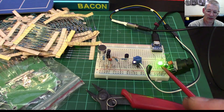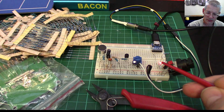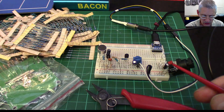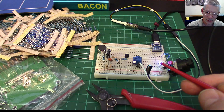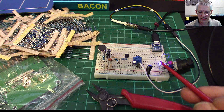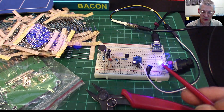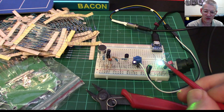The effect you're getting on camera is nothing like real life — all LEDs seem to appear as a white blob with just a halo of color. In real life it's much more intense. This is a bit of a problem for the Christmas tree project because I was going to control these via the Arduino — flash them or fade them — but they're doing their own thing. If you put pulse width modulation down them they just effectively turn on. This LED is effectively a tri-color LED with a little tiny chip inside.